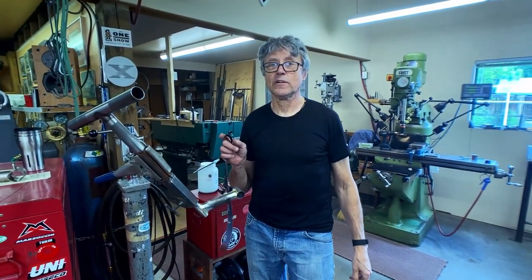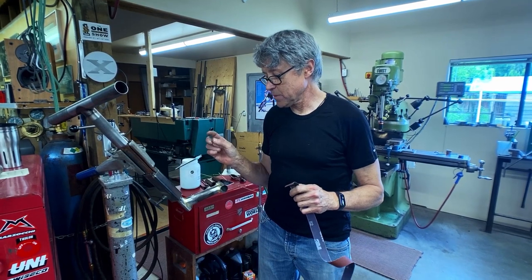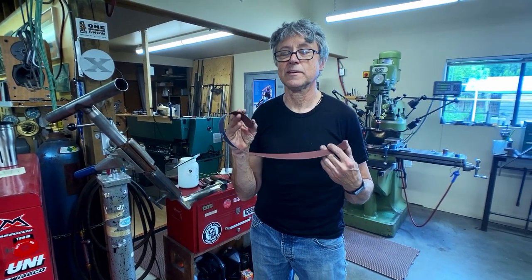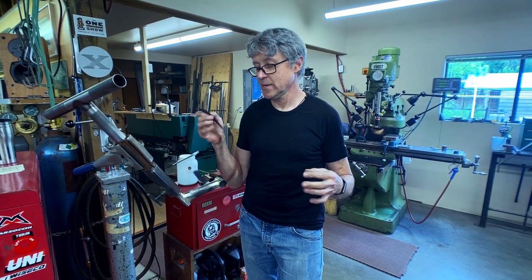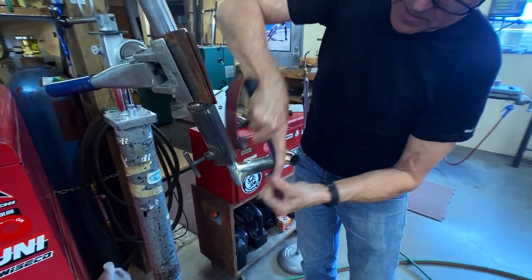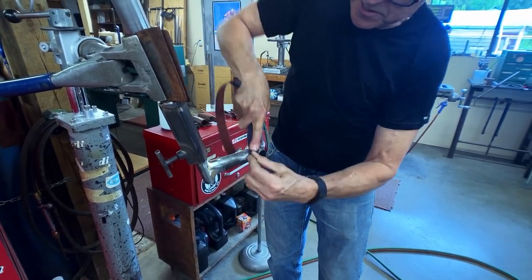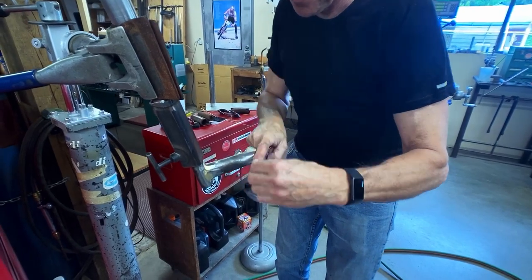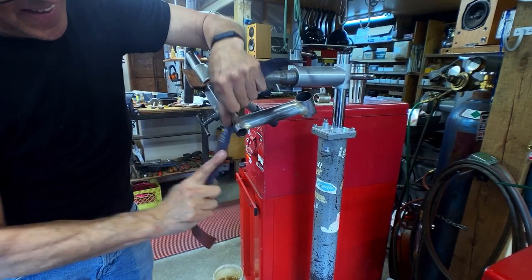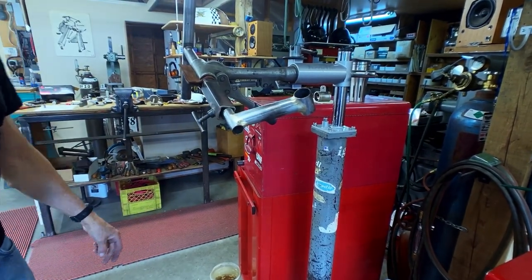So I've done about almost a quarter. I've got a quarter-inch wide belt sander I made a long time ago — saved myself about 400 bucks because if you buy the real thing it's 700 bucks. I did the spiral roll, then the quarter inch belt sander. The last step is using emery cloth. I had a student in frame building 101 named Mario — he had a sense of humor and he named this 'fine fingering,' so it stuck. This is what gives it the final smoothness.